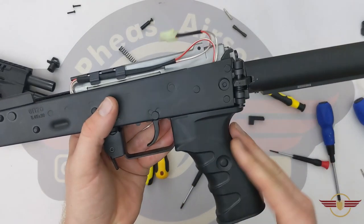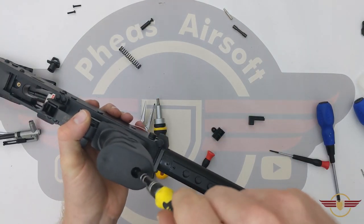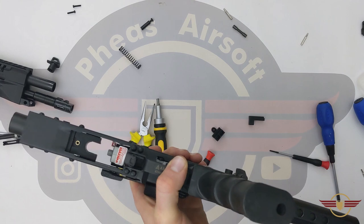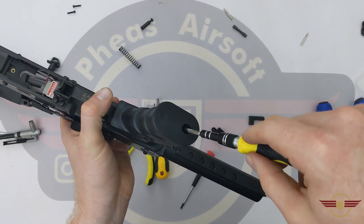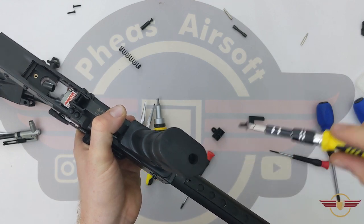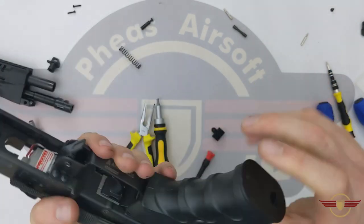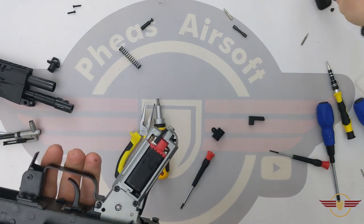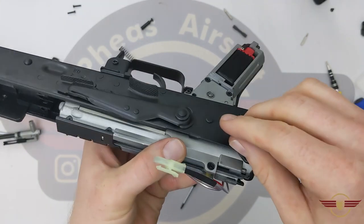So the next thing then is we're going to release the gearbox out of there and see what is inside the gearbox. So again, I need to get in an even bigger one. Now these are Allen key or hex bolts, but I find that Torx often grip a little bit better into these screws and remove things. So I've just taken that out, and that should now release, and it does. Everything's nice, not in a bad way tight fitting, but very snugly fit, which is always reassuring.